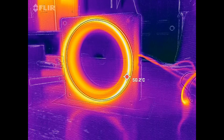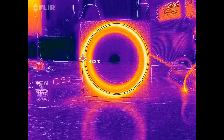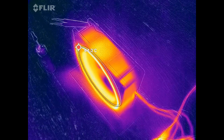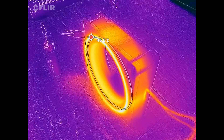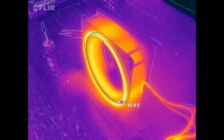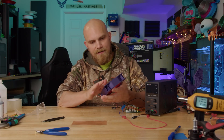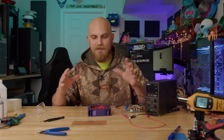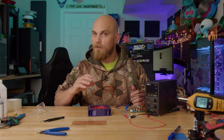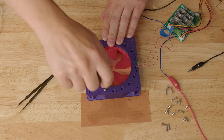That's a problem. While I was running this out I took out my thermal camera, looked at it through the FLIR, and things were getting toasty. I was concerned because this is made out of PLA, and I was afraid if things got a little too warm stuff might let go. I also messed around with a bunch of other power supplies off camera — tried a PC power supply, nothing great; tried a different PC power supply, nothing great; took it up to 24 volts, still same problems. And I just now noticed that something is touching something, so we're going to have to pull this open.